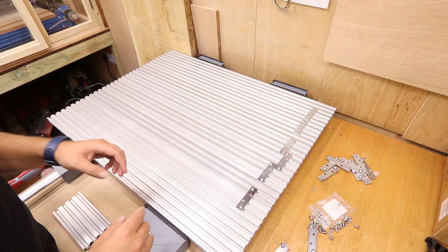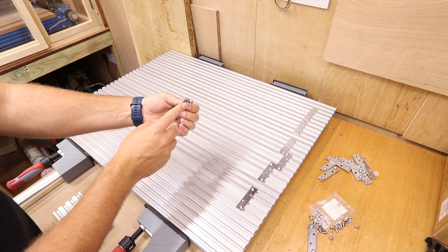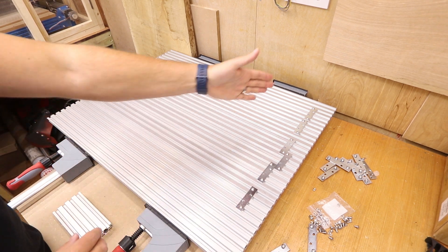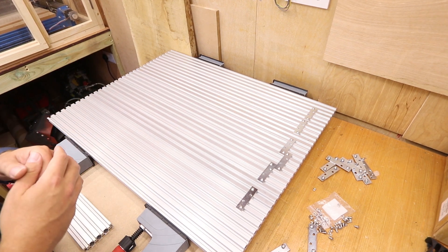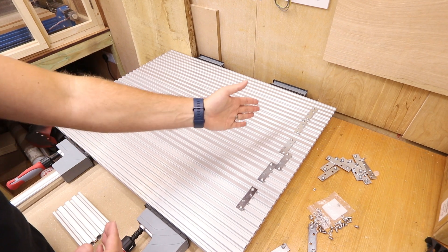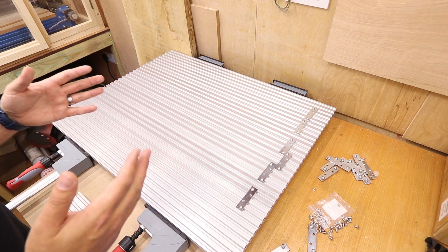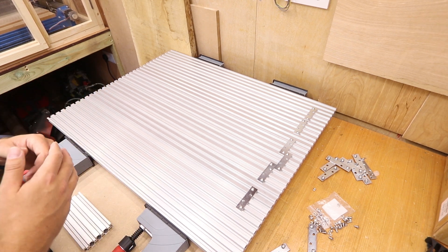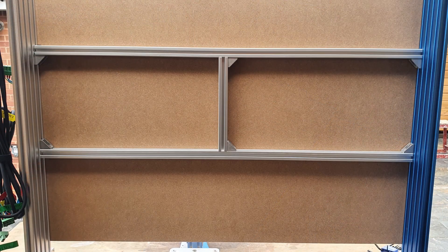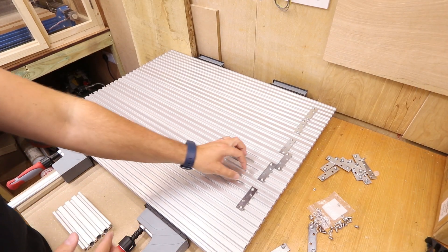We're holding it all together with brackets using 8mm M5 bolts with M5 T-nuts. Ideally for maximum strength we'd have one continuous piece, but I was struggling to find one with all the holes aligned with the slots in the extrusion. Also, from previously fitting the MDF board, I put two supports down the middle to support it, and I'm going to leave those in place even when switching to the extrusion — so I've had to leave slots for those supports.